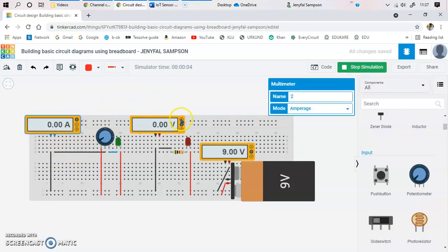Now starting the simulation — you can see voltages, and I can measure current. The total current is 234 milliamps. You can see that 221 plus 13 equals approximately 234, which verifies Kirchhoff's Current Law — the sum of branch currents equals the total. When varying the potentiometer, the current value keeps changing. When the potentiometer is at its minimum value, both LEDs are off. At the maximum value, the current keeps increasing.